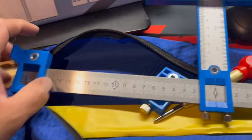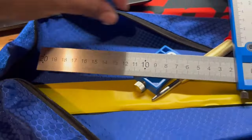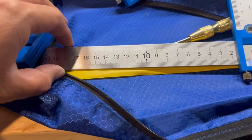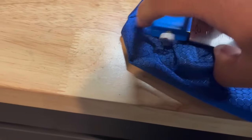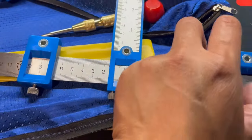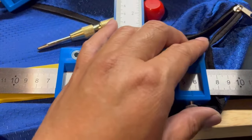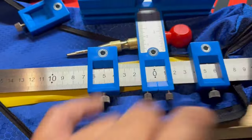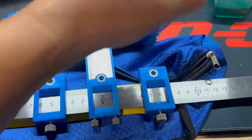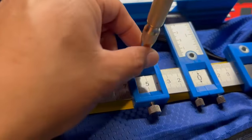This portion here you'll probably take off if you're just doing center, then add this piece in on this side and slide it over. As you adjust it, slide them over to the handle size. Once you get everything lined up, centered the way you want, mark the two holes with this for where you'll drill. The center punch fits perfectly into here so you don't get off-center holes.